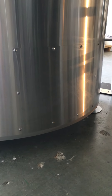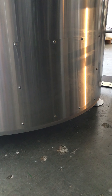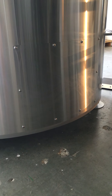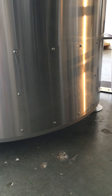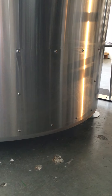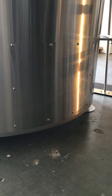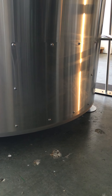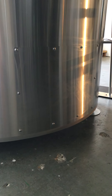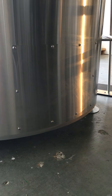This little hatch here is the access hatch for the burner box. When you take that panel off there's going to be a door inside — you don't pull the door out, you push it in, so give it a little jiggle, don't force anything, just jiggle it in until it drops in, then put it face down. You're going to see a whole lot of ceramic insulation — it'll be bright white. Before you fire up the kettle, check to make sure nothing came loose during shipping. You should not see any flaps hanging around. There can be some mushrooming near the kettle bottom and that's normal, but nothing should be hanging — if there is, fix it before you fire up.